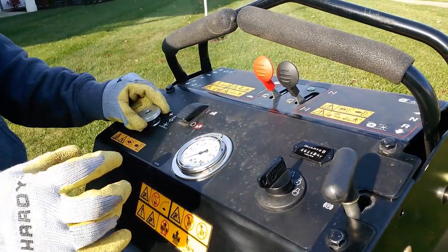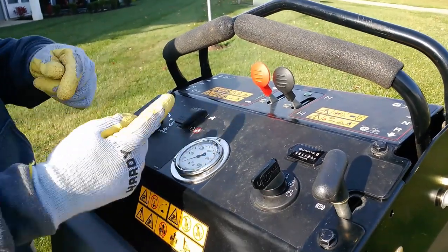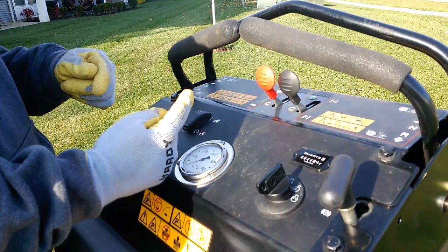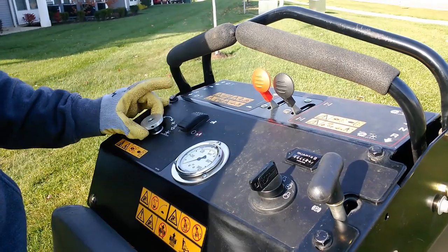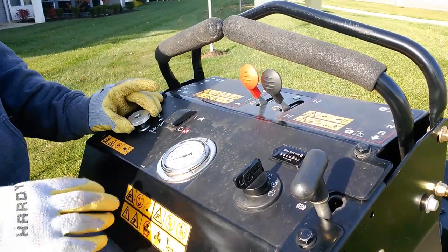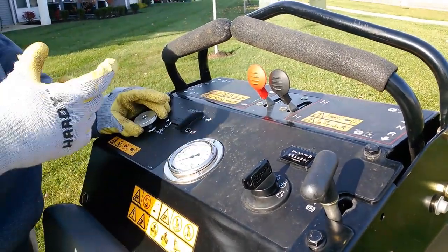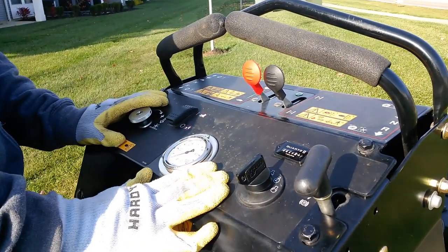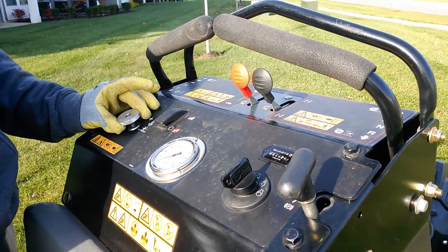Now, I always tell my guys, try to get about a 2 to 2.5 inch plug. You're not always trying to get a plug that's 4 inches long, because you might get into cable lines that deep. You could tear the grass. So generally, you'll adjust this. Sometimes if it's hard or soft conditions, you'll adjust this, but I use as little force as possible to get between a 2 and a 3 inch plug when I'm aerating. It's less stress on the machine, and it's safer on the turf. You don't have to worry about tearing things up so much.